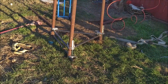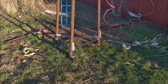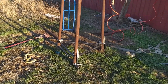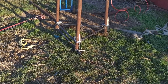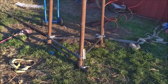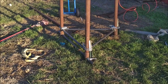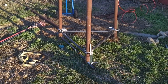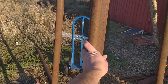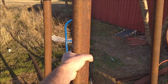I've been asked a couple times — I tried to explain this in previous videos — part of this experiment is setting this up with no concrete and no guy wires. I just want to do it that way. The way I've got it set up is with eight-foot-long t-posts sunk at least seven feet in the ground, and the tower legs are clamped to those t-posts. I've got cheap little clamps right now and I need to do better, but those clamps are not going to come away without ripping those t-posts out of the ground.